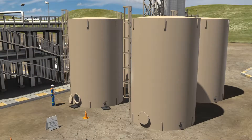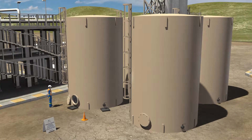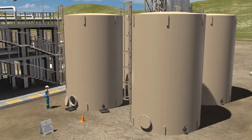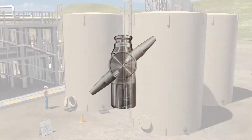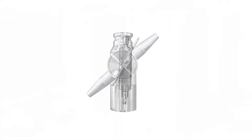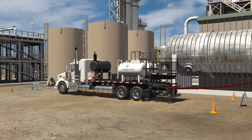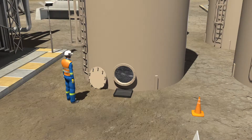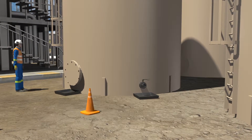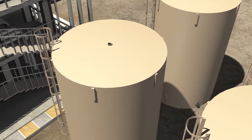There are two methods to complete the cleaning of the inside of a tank. In the first method, the cleaning can be performed without the prolonged exposure of a cleaning crew inside the tank. The cleaning team will enter the tank with a gamma jet — a high-volume, low-pressure wash tool — and/or a 3D tool, a high-pressure, low-volume wash tool that is attached to the high-pressure pump or chemical unit. During the cleaning process, the man door is closed, so either a secondary manway with a collar must be made to run the required line into the tank, or the line must be fed through the top vent of the tank.